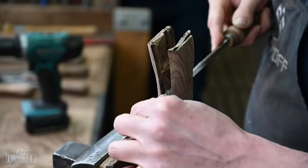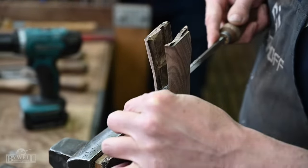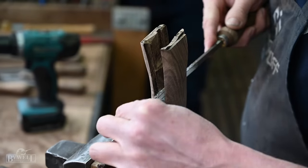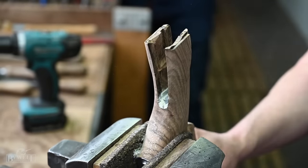You let it cure for 24 hours. And then you take it off and take the excess material off to clean it off and put the stock back on, and then you're ready to go. But you have to take it off afterwards again, clean it off and put the stock back on to be ready to go. So the bedding is similar to what you would get on a rifle bedding. Actually exactly the same thing. So really, with this technology, with this material, you can achieve 100% fit.